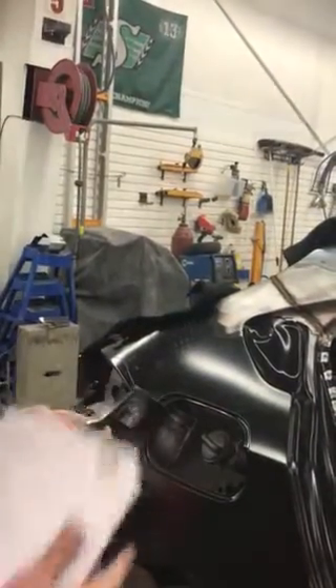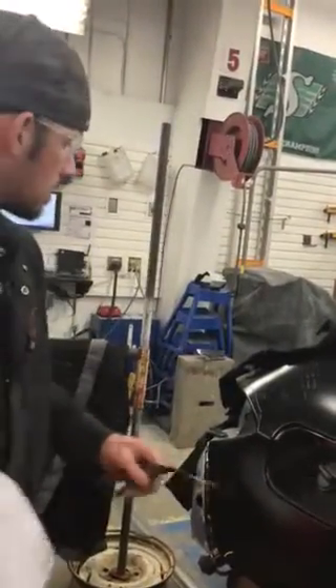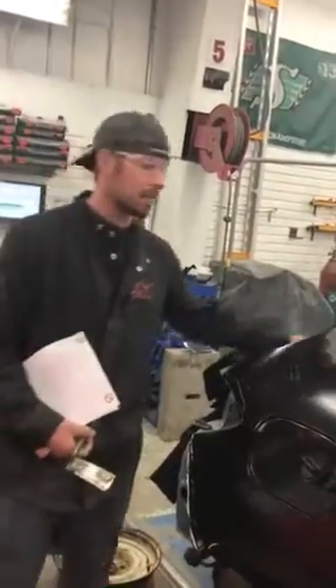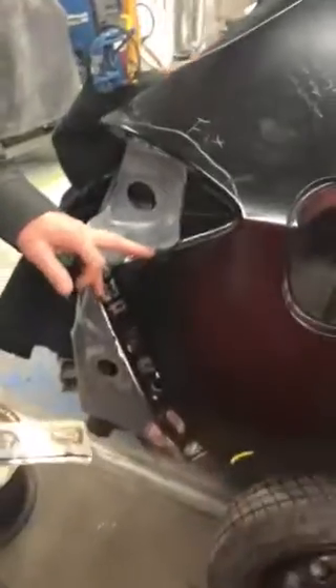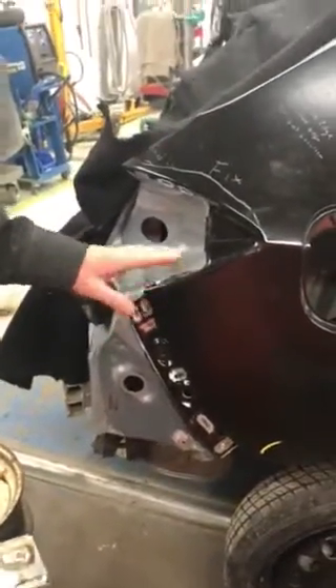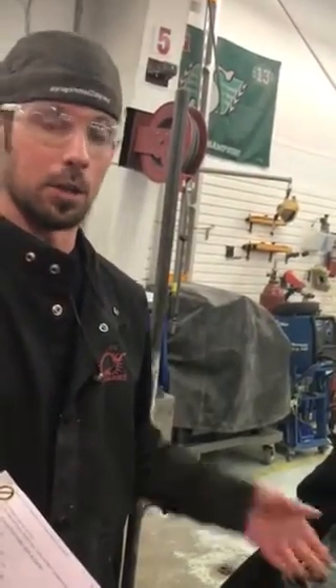You're looking for the proper heat effect zone on the back side and the proper face. I've got 17 of them to do all the way along the back side here. To prep each slot took about two minutes.